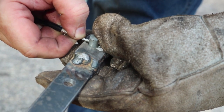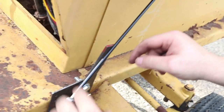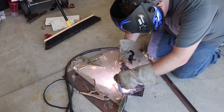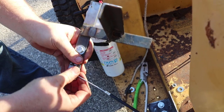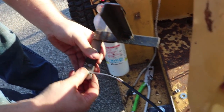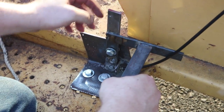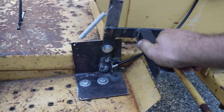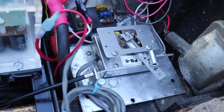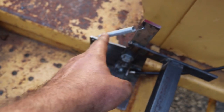This slot needs to be a little wider. We started test-fitting what we had of the pedal so far to make sure the cable would line up and figure out where my foot would come to — some of this is based on a person's leg length. Then we welded on a piece of angle iron that would be the actual foot pedal itself, and back at the tractor we popped the end of the throttle cable in there and mounted it up to the bracket, which is now bolted through some of those foot plate drain holes. Here's our pedal mechanism — it connects up to the throttle, has a spring in it, and this also has a spring. It seems to work.